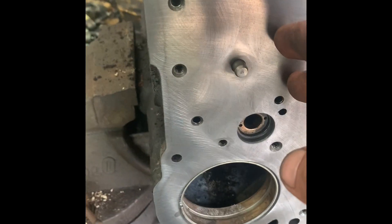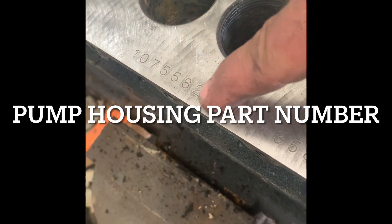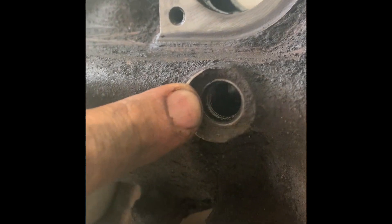I'm cleaning up the governor's side — this is the governor's side — cleaning up the top where the pump goes. Here would be your part number of your housing. Fuel inlet and outlet are 11/16ths usually, most time JIC, 7/16ths on them. The O-ring plugs take a 1/8-inch Allen wrench — they're not pipe plugs — except this one, which is 3/16ths Allen.